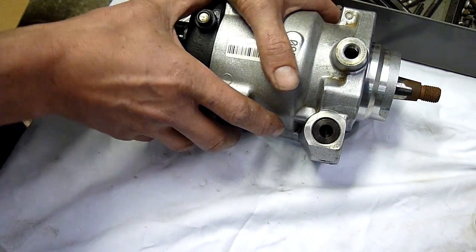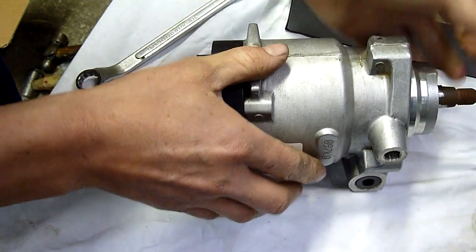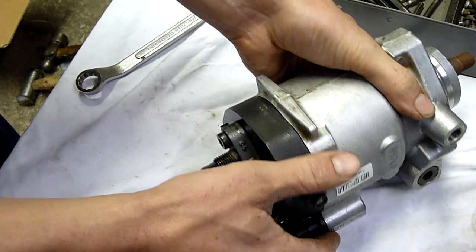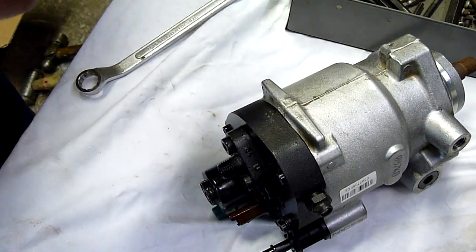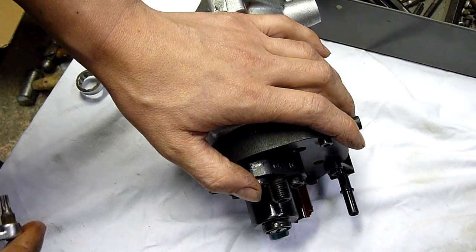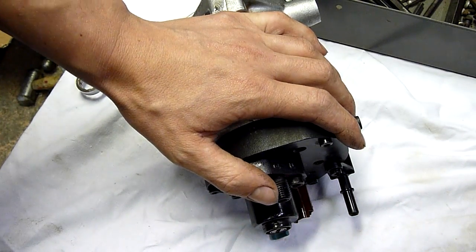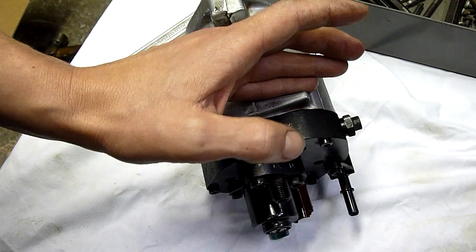Go figure. Getting them straight out of France was actually more expensive. So it was an interesting little endeavour, and a lot cheaper than obviously getting Hyundai to supply the parts, much less fit them. But the pump put metallic debris through the injectors at incredibly high pressure. As you can imagine, going from the high pressure side to the spill side, the return,